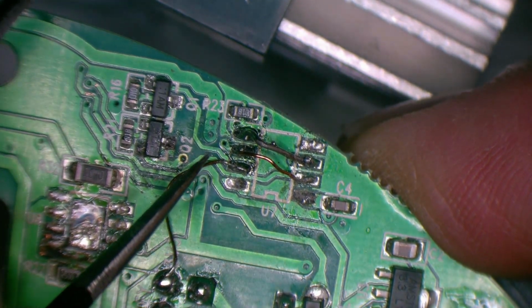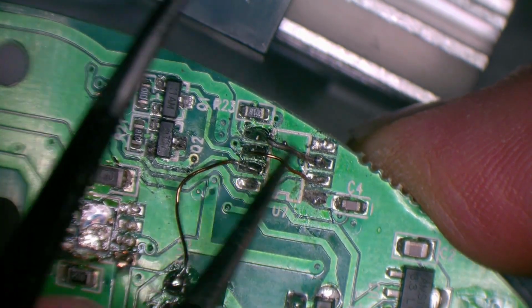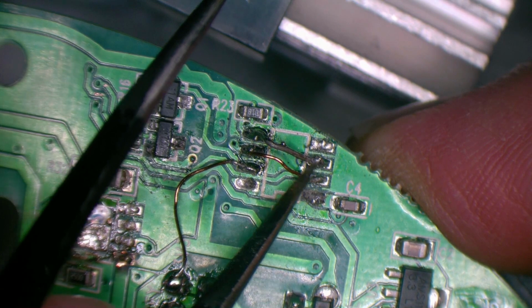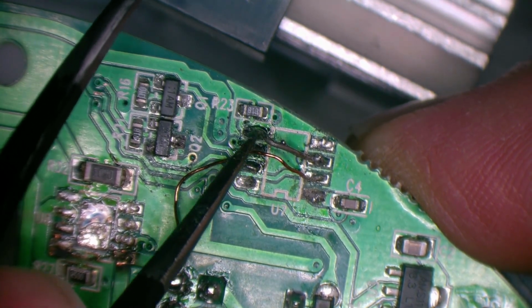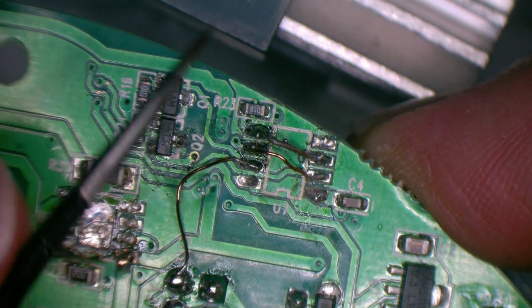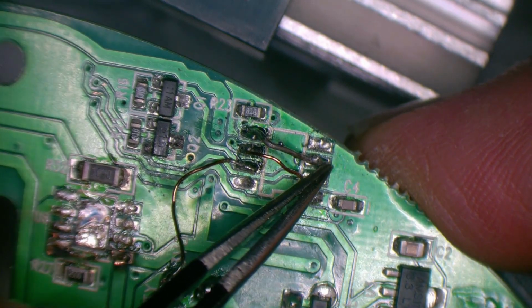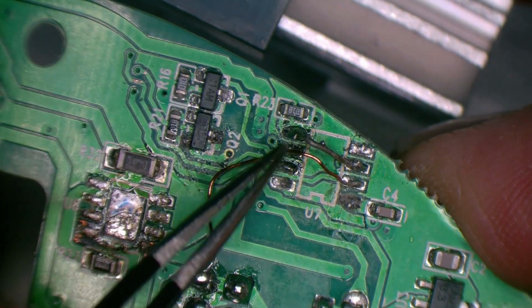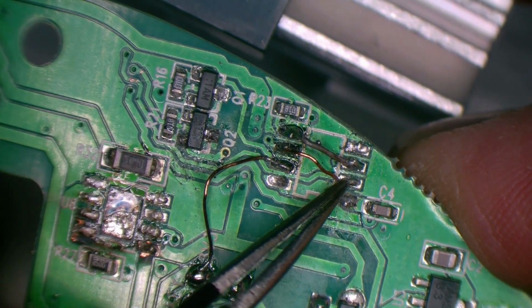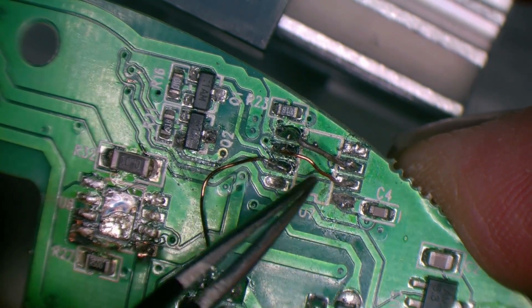The only weird effect I'm getting as a result of bypassing it and just jumping the motor controller directly is that this seems to have to be inverted, because on the software, the speed controller at the lowest setting is full speed and the highest setting is the lowest speed. But that doesn't make sense for the other pin, because the brightness does work correctly. So this one should not be inverted.